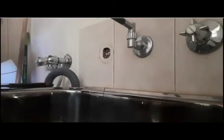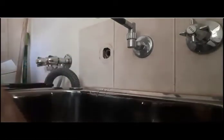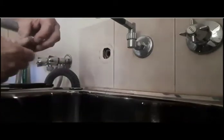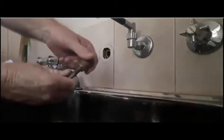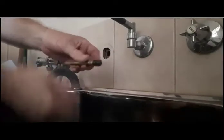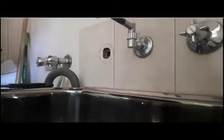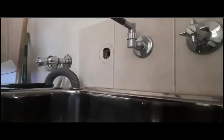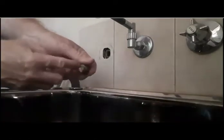Right, off. Grab your trusty pliers, rip out your washer. Now, I change all this kind of stuff out. Take your body off, unscrew it here — unscrew this, like that — and you'll expose the O-rings. Do all that at the same time, otherwise it's going to waste your time and money, because the O-rings are worn. That's where you'll get water — especially on basins, you'll get water coming out at the end.